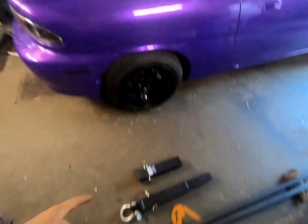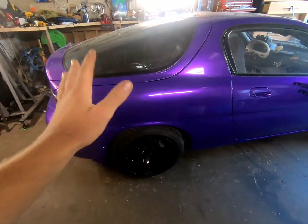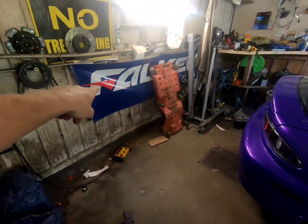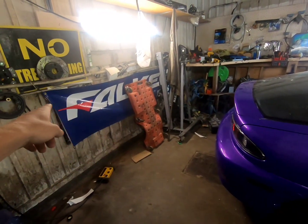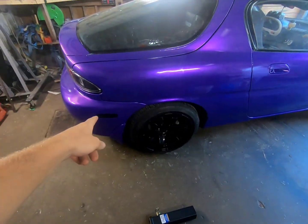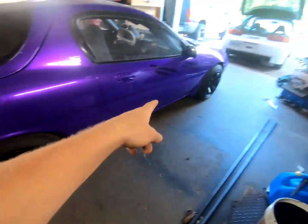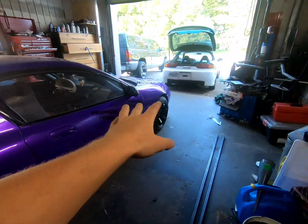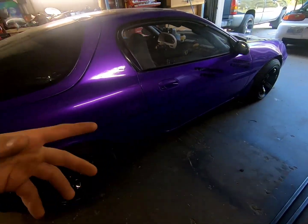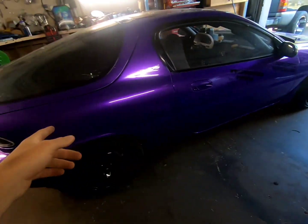Anyways, so my theory is, just say I didn't do this hitch and I would strap up to the rear subframe and it's attached to my truck, let's say. And my truck is solid, somebody's pressing the brake, and I am sending it, letting it breathe with all the power I've got, spinning the tires. All that grip, because all 4 wheels will be spinning and trying to push the car forward, that's a lot of strain on the whole car.